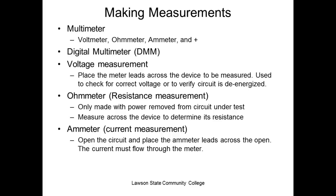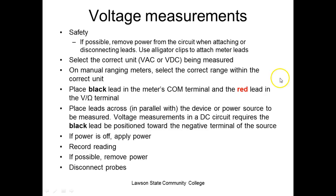What do you think they do? They put it on amps and measure amps. Then they don't take the power off. They hook their circuit back up and want to measure volts, so they take the meter and stick it in there without checking. They don't switch it back over to volts. So that's one thing you have to learn to do on these meters: check things, double check things, to make sure you've got it right.